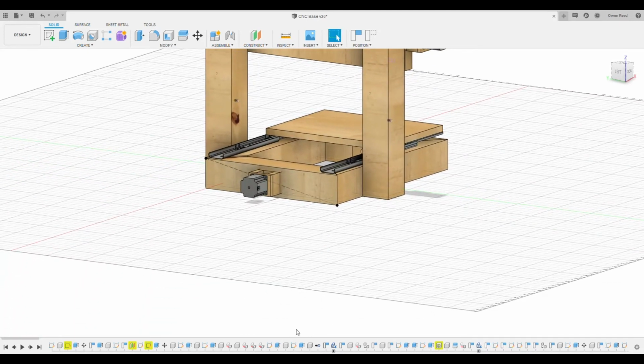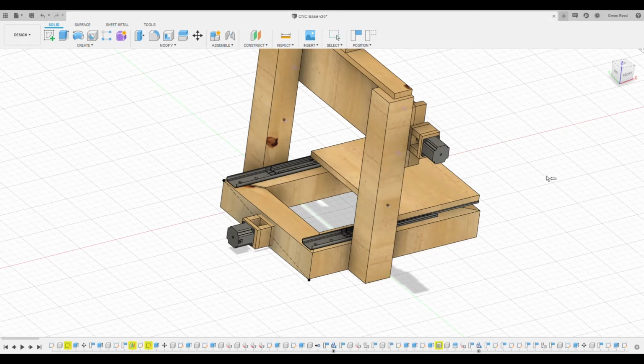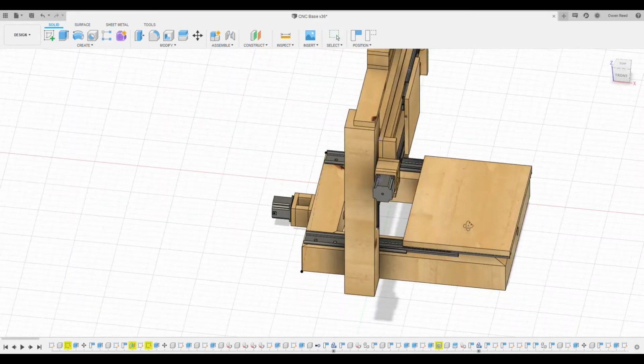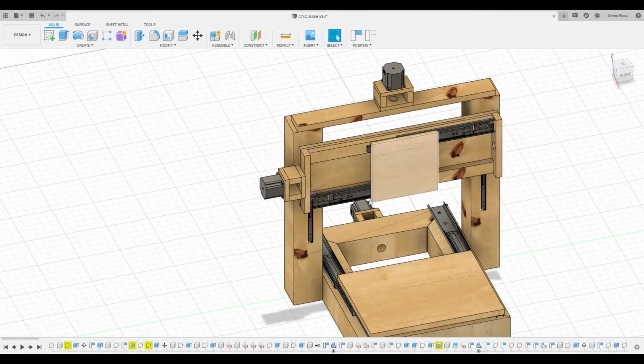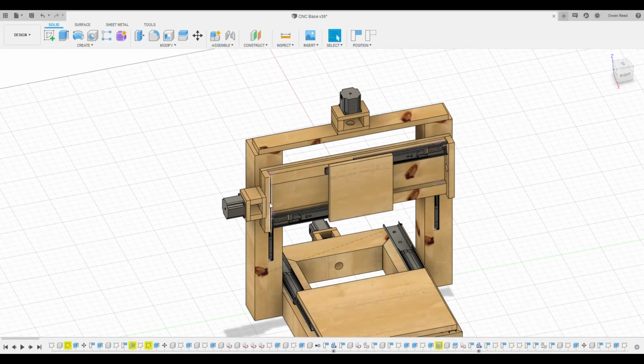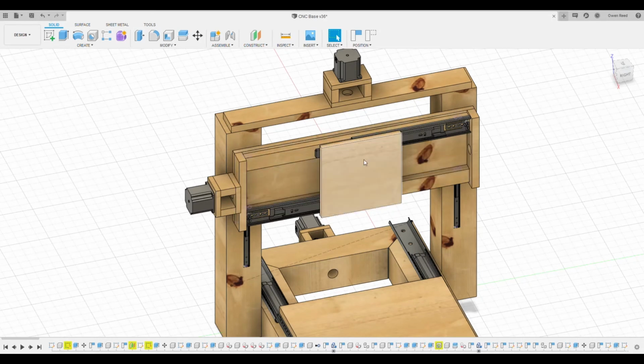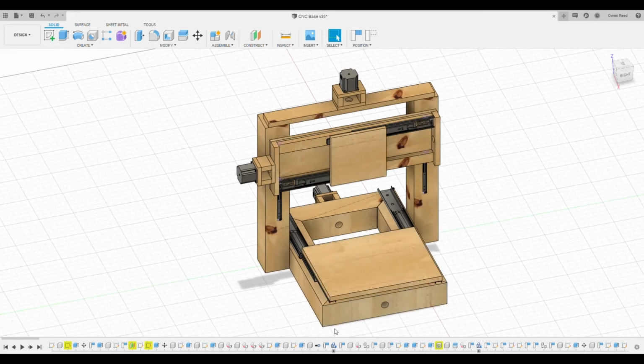In the actual version, we have a wooden block modeled across here, but I didn't put that in this CAD model because I wasn't exactly sure where it should go, and that was a decision that I made ad hoc during the actual design. In the version of this that is uploaded on the website, everything is modeled in completely, but this is the working model that I've been using throughout the build process. And effectively, it's the same movement system for forward, back, left, right, and up and down, relying on this rotational movement and these motor couplings that effectively just make it much easier to set up, and a drive shaft that goes across here that moves the plate. Then there's a few other bits and bobs modeled on that I put on ad hoc that allows me to press the buttons which serve as limit switches, but for the most part, this is the design that I'll be taking you through how to build.